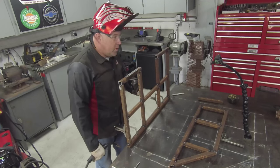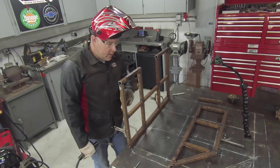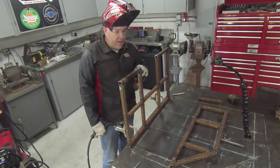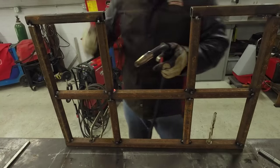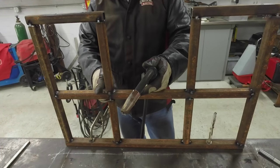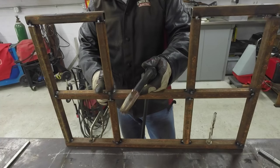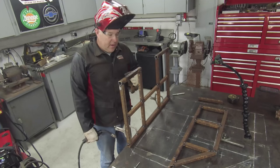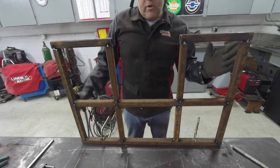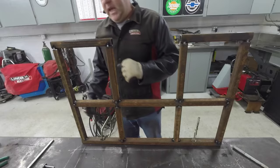I've taken this apart and I'm going to get the welding done. What I'm going to do is weld these in opposites — I'm going to try to do everything at an opposing angle so that the contraction force on this side opposes the contraction force on the other side. That way I don't create forces that'll cause everything to pull one way — like if I weld everything in one direction, this whole thing will try to lean.